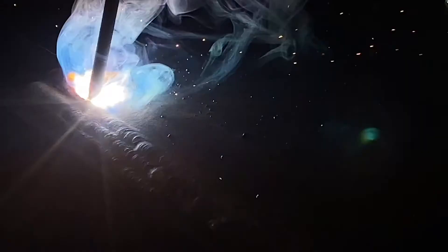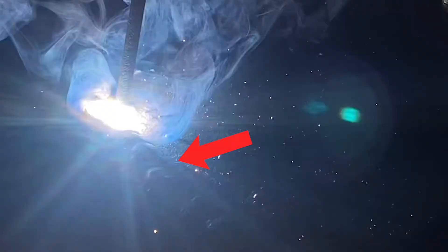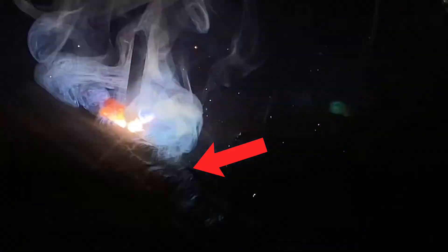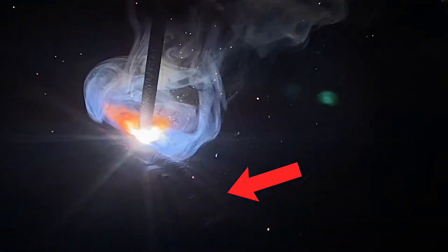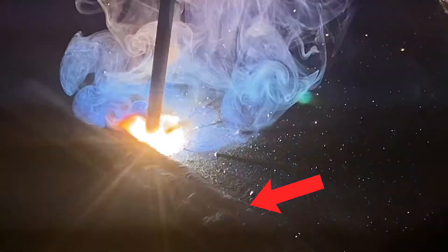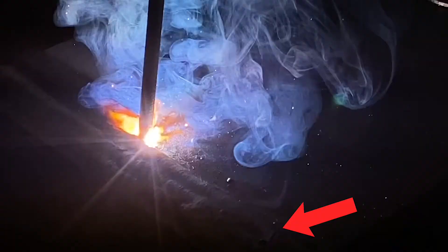As you can see, as I'm welding here, I'm keeping my rod right at the toe of that first pass, welding right down that groove. I'm consuming 50 percent of that first pass. I'm running nice and slow, give it time to fill in, give it a nice tight arc length.